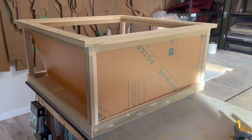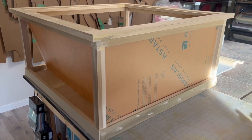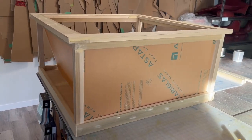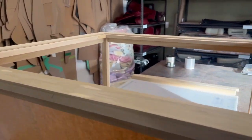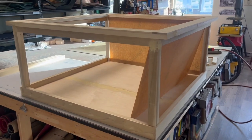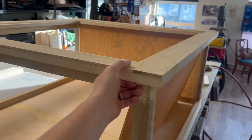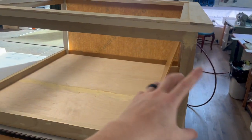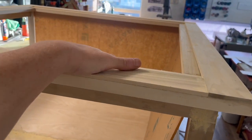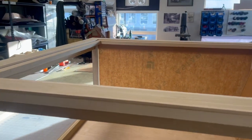Here with my next installment of my 1/32nd scale Border Models Lancaster build. So the aircraft is finished in the last build, and now I'm building this custom display case slash coffee table for our living room, so I have a place to house it. I just built this out of wood myself, and it's going to have this removable top. I'm using plexiglass for the perimeter sides, and then it'll be 6 mil tempered real glass in the top, so it can be a coffee table.